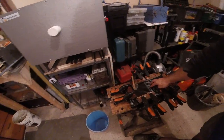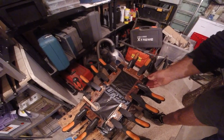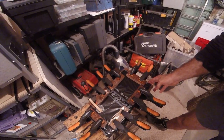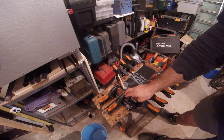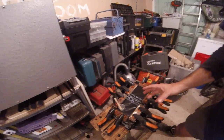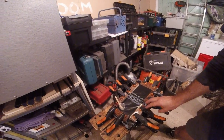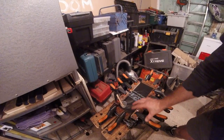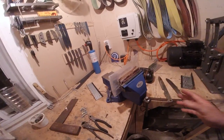You've got to get the scales as flat as you can, which is why I don't just rely on the linisher — it's never as good as going on the glass plate. What I've fastened them on here is actually a block of granite — one I stole off the wife, she found a couple somewhere pretty cheap. This gives me somewhere really flat to push on. I like these spring clamps; I have used standard screw-down clamps but they're quite difficult to get a really good finish with. These give a really good squeeze and continue to push the resin out for a good seal all the way around, because they're spring operated.